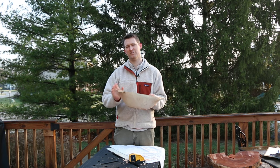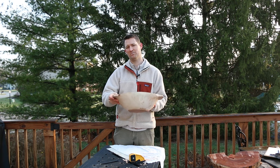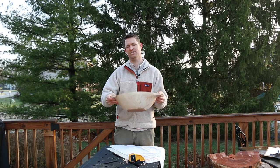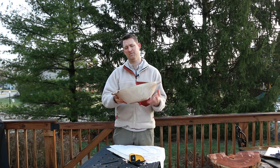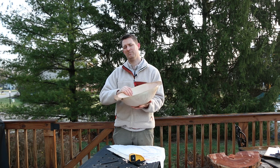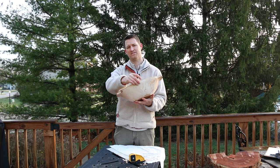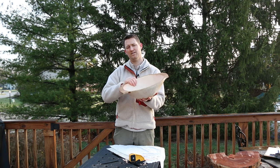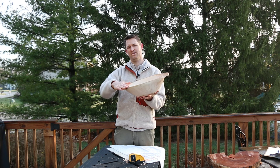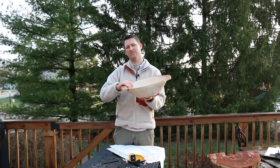In the previous videos the bowl was kept in a plastic bag between carvings, because oftentimes I can only carve on weekends — I do some carving, put it in a trash bag, and leave it in a cold location until I can come back to it. You want to keep it green until you've carved it down to relatively thin walls, because that'll do two things: one, thin walls will dry quicker on the side grain, and two, thinner walls will allow the whole bowl to warp slightly as it dries rather than form cracks.